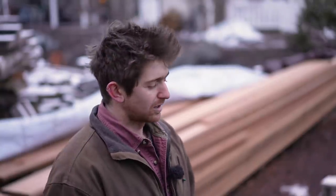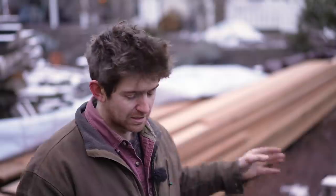So it's a bit of a catch-22 there. It's very easy to get a reading, but to know whether that's really accurate is another story, and I think moisture content and specific gravity are two quite misunderstood terms, actually. So I tend not to take moisture content readings very often, and I haven't really been doing that with this timber. I've been just going off of how it feels to sand and to work, and the weight and so on, and a bit of intuition, a bit of guesswork.